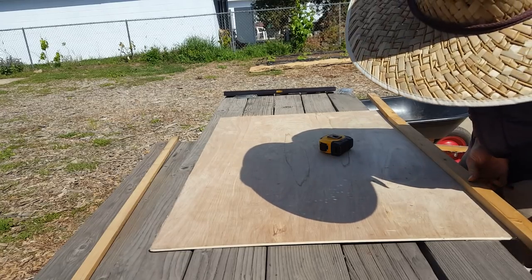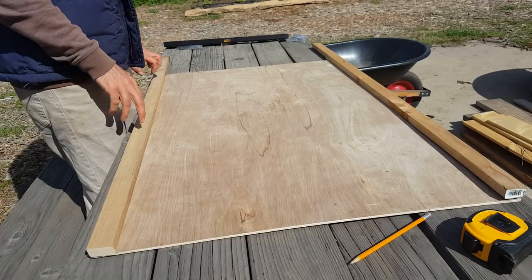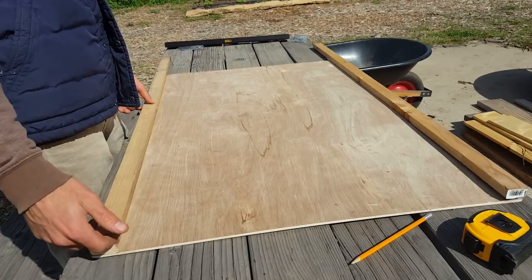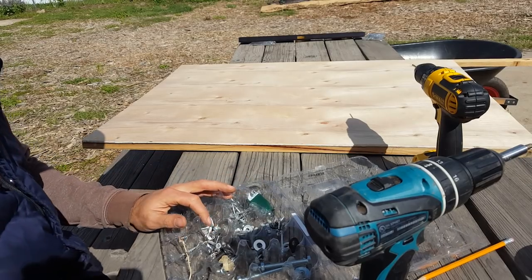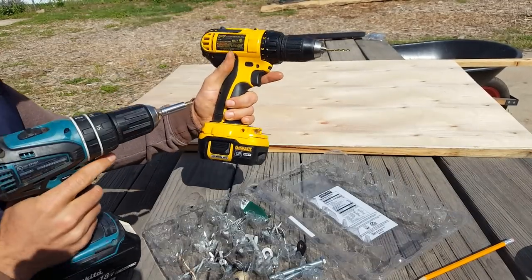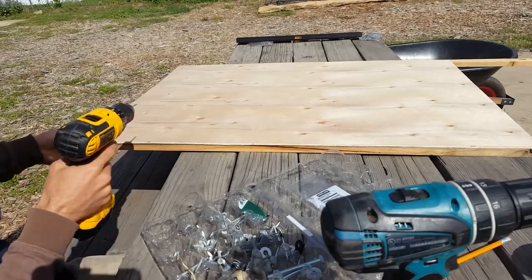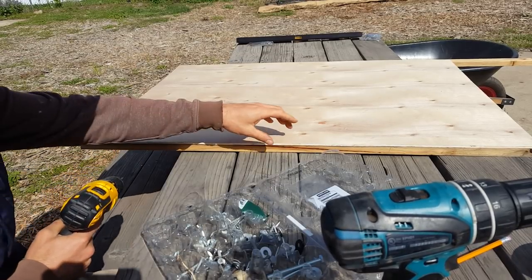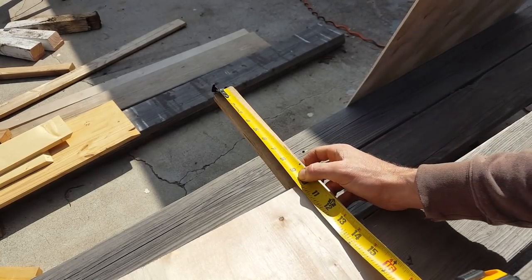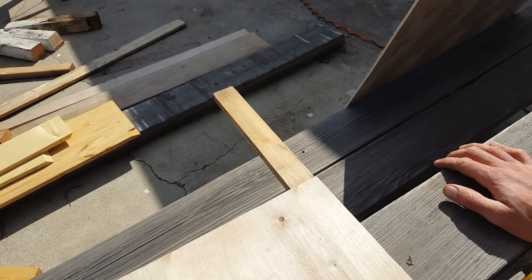By doing this I don't really have to measure anything — I just make marks and cut. I've got my frame and leg pieces here, so now I'm gonna screw this in from the other side using some recycled one-inch screws. It's really nice if you have two drills — one for drilling a pilot hole and the other for driving the screw — because both boards are so thin and prone to splitting. It's really important that I make these legs identical so it'll be way less prone to falling over.